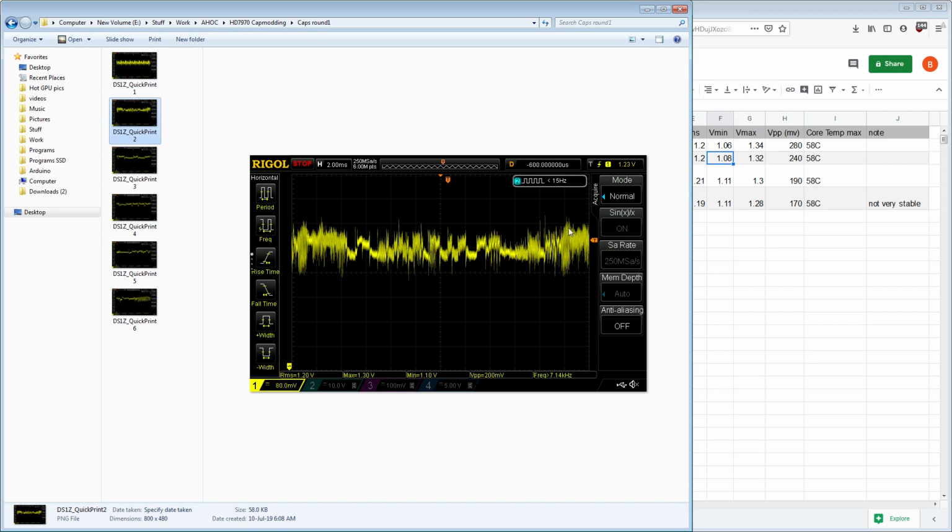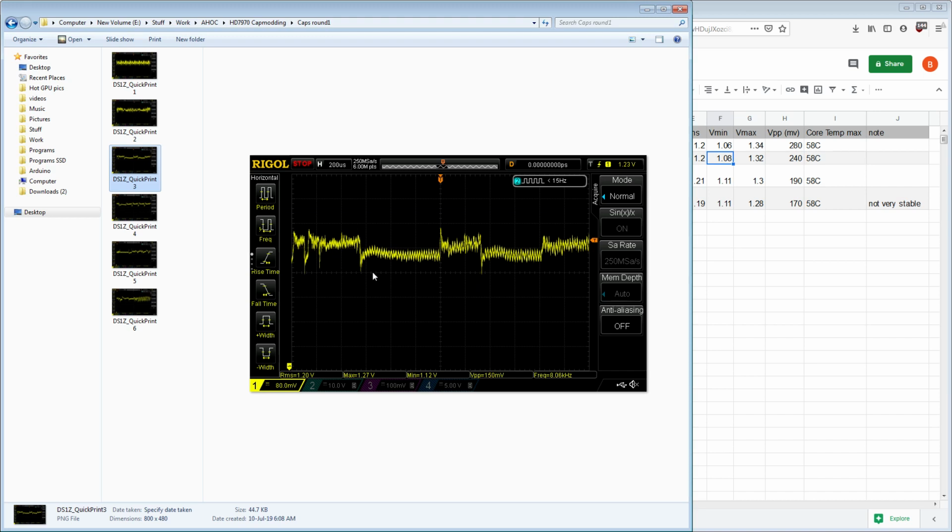And then we have some zoom ins, and that's the mess I was talking about. Here we can see some pretty obvious transient spikes in between. If we zoom in on some of those, there's still a good amount of undershoot and overshoot, but it's a bit more controlled. Then I found this mess, which could just be the GPU, because I'm not seeing any obvious load release spike, but maybe that ramp down there, I'm not sure. These seem to be going too quickly for it to be clear what's going on. Then here we have some spectacular overshoot. And then that looks a bit like a load release, and then it immediately slams back into load. GPUs are just very, very noisy loads because of the type of workload they do. So basically, a mess.